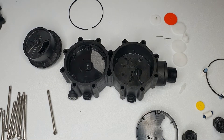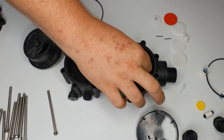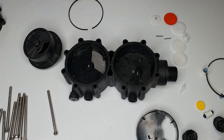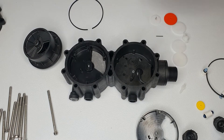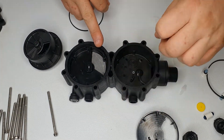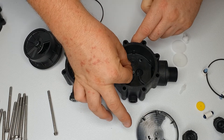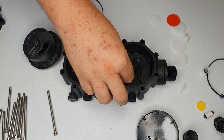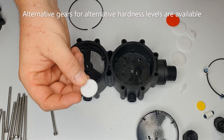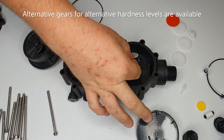Now we're going to build the service side. First of all, take that main bearing and put it in — we call it a little top hat — and that goes into position. Small pin goes in position five, longer pin in position four, and then position three. Take the small gear with the top hat on, nipple up, and pop that into position five.